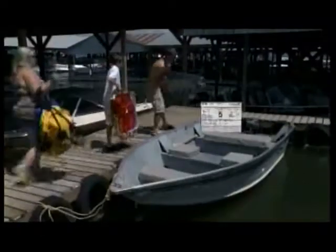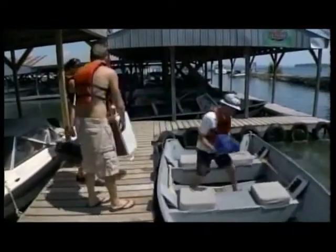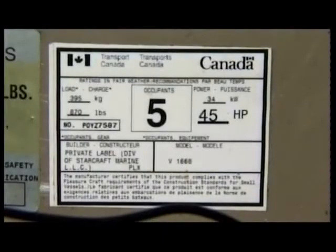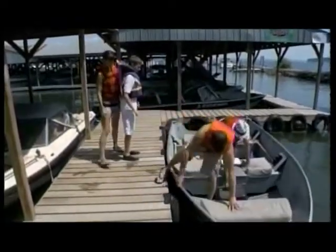According to the Guinness Book of World Records, the record for cramming people into a Volkswagen Beetle is 24. According to the capacity label on this boat, 5 with gear is pretty much the limit. All recently built pleasure craft, not larger than 6 meters and capable of having a motor of 10 horsepower or more, have a capacity label. This label indicates the maximum total weight that can be carried, including the number of adults within that weight limit